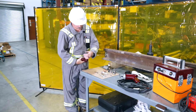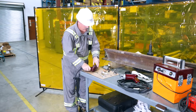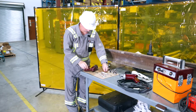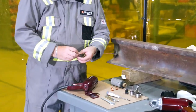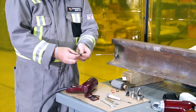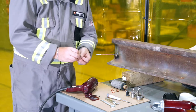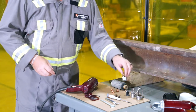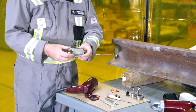Within the gun, you've got your ferrule holder, your pin holder underneath, and your spark shield. Inside the gun, if you open the lid to the handle, you have your trigger assembly. Part of this assembly has two trigger contacts — two bolts that when the trigger is pressed, come together, allowing the current to go through and fire the gun.